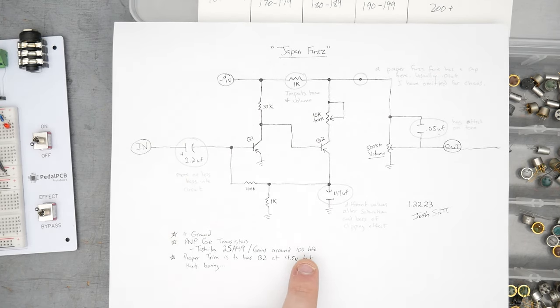So this is full volume. And if I pull the pedal volume back a bit, and then off. There's a pretty atypical function of the volume control here. It's completely off at zero, which is not atypical, but when you turn it up, it goes full fuzz immediately. It stays pretty consistent for 70-80% of the sweep until you hit that fade out moment. And then it clicks into that last setting with max volume.